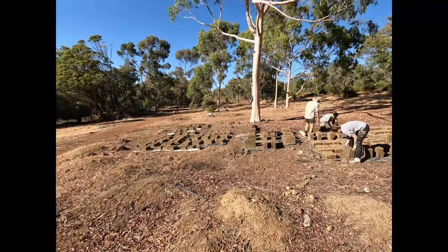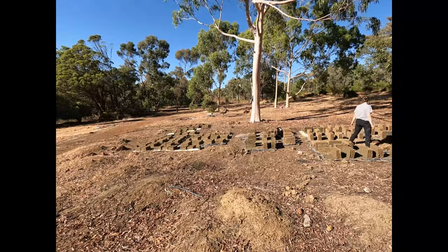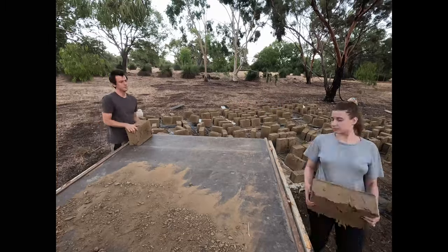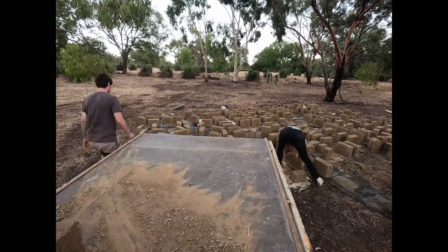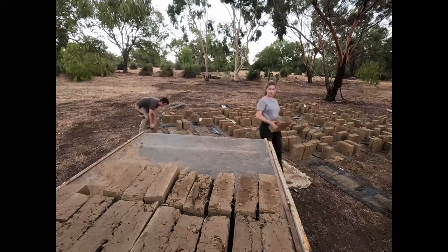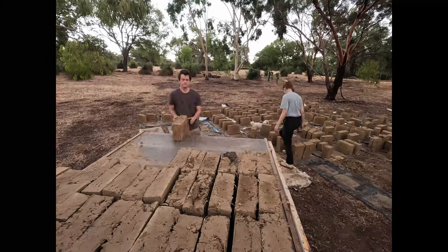Depending on the weather and the mud mixture, anywhere between half a day to two days later we'll go and turn the bricks onto their sides to make sure the side that was contacting the ground gets a chance in the sun to dry out before we move them. When the bricks are ready we'd load them into the back of the ute and sometimes the trailer as well, and drive them up to the shed we were keeping them in. This is pretty variable because it depended on the mud mixture and the weather — you'll see as we load these bricks on they're all so different. You don't know what mix you're gonna get that day, or even what shovelful of the mix you're gonna get.